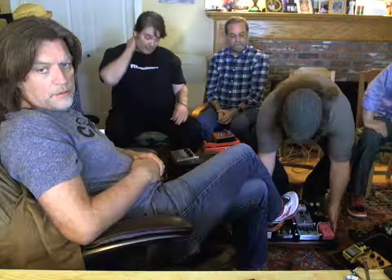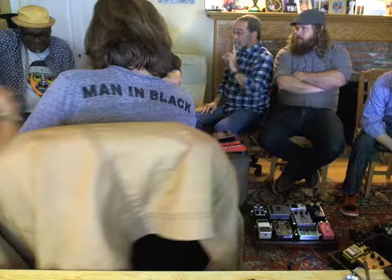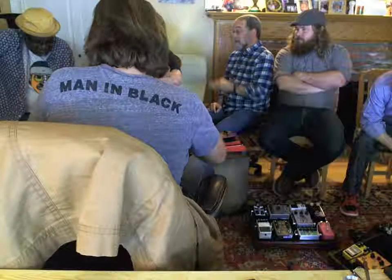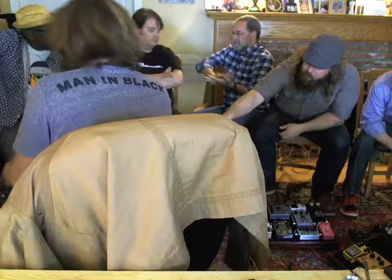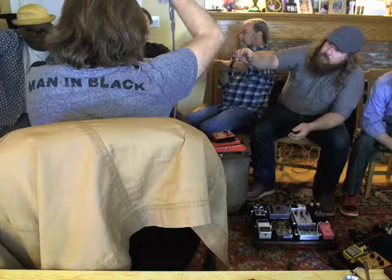Have you ever tried Mu Metal around the AC? We should actually talk. You're a metal guy. Yep, Mu Metal. When I was at Data General, we used to use Mu Metal shields on the top of all these 15 by 15 boards. Back in the 70s, those shields were $75 each. It was three layers, and then a non-conductive layer on the top and the back.